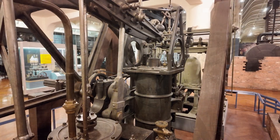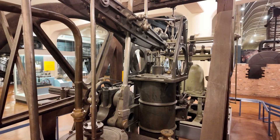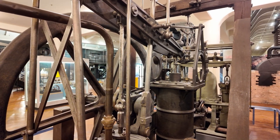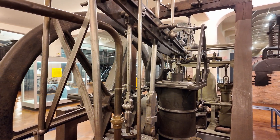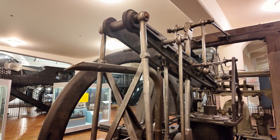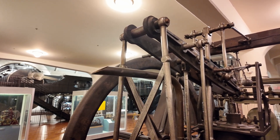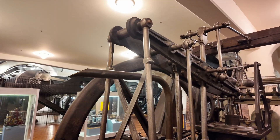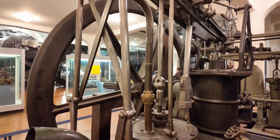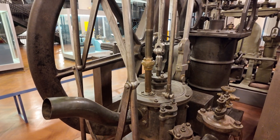So why does that happen? In typical Grasshoppers — all steam engines really — your piston has a piston rod coming out of it which must go straight up and straight down, and that connects to the main overhead beam. The beam in a typical beam engine goes to a fixed point on the fulcrum and rotates across the fulcrum. In this case, this fulcrum will actually go back and forth, rotating here, as well as allowing it to twist. Part way back, you have a feed water pump, and you do have a bit of a parallel motion connected to the top of the feed water pump.